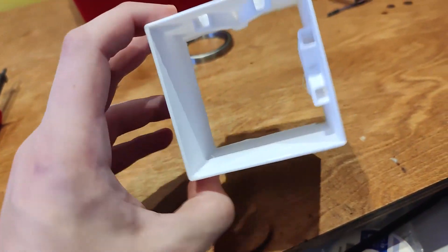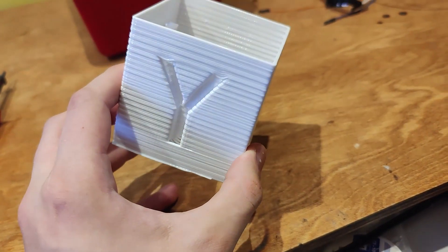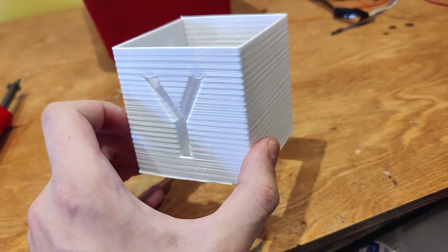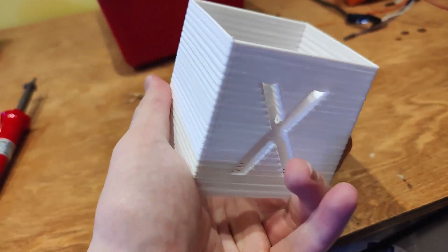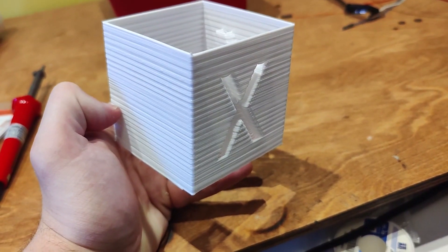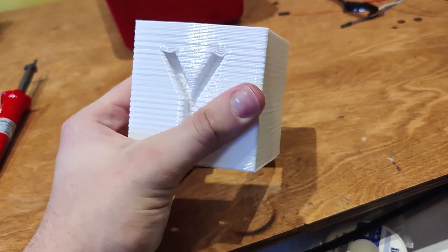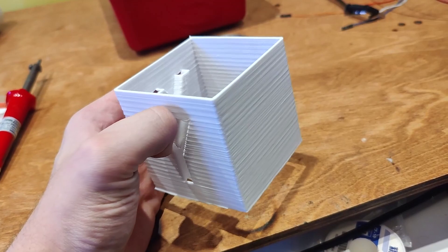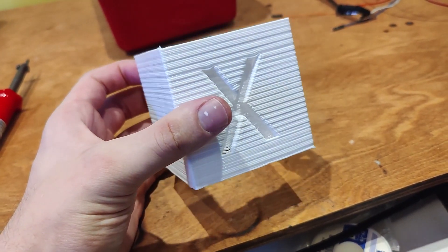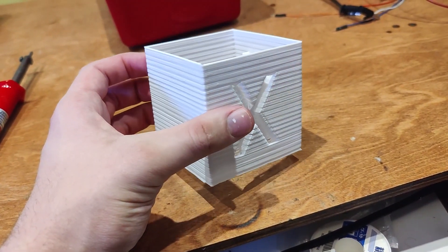As you can see, it's nice and glossy. Apart from the Z-banding, all of the directionality is right, so everything's square. The print worked better than I expected. I'm going to do a little bit of tuning, maybe try to add another fan or put a fan bracket on there, and see if I can get it printing even better. After putting the Super Volcano on there, I'm a lot more excited about the possibilities of what it can do — it seems to print a lot better with actually being able to heat up the filament all the way. So I'm going to do some tweaking, some tuning, maybe add a few things, print some more stuff, and then update the YouTubes.